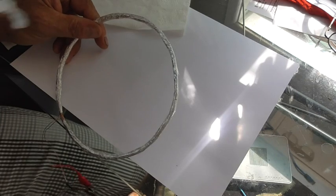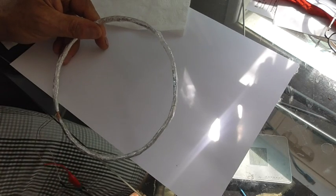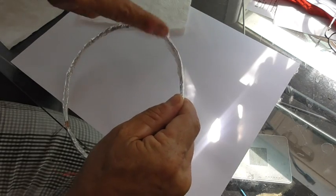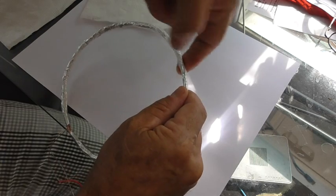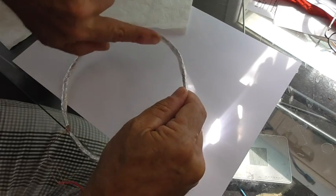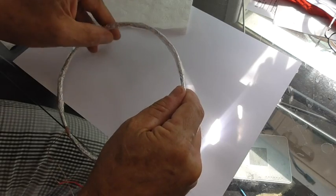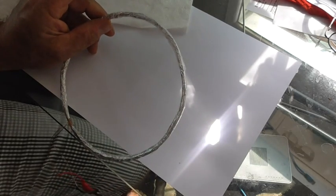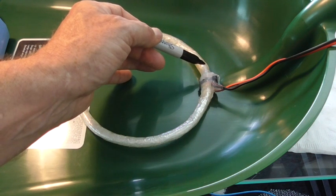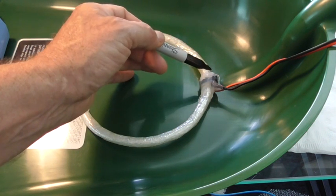You've got to go over the whole thing with some silicone. Be warned, this stuff really sticks, so don't get it on your clothing, and be careful where you put your hands afterwards. You want to make sure that seals off really well, but it can still bend and not crack. Because if it cracks, it will get water in, and water in the detector coil creates havoc. I've coated that with silicone and given it a good three layers of strong tape over the top. You've got to keep these two wires separate, solder them, make sure they're not touching, and completely seal this off with silicone.